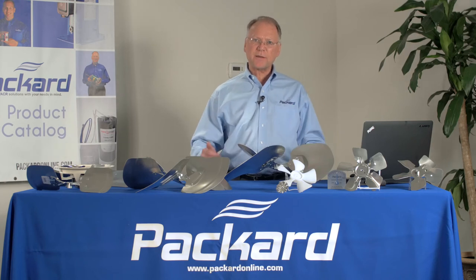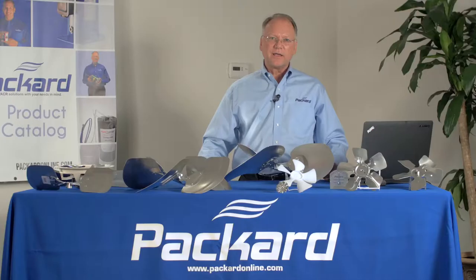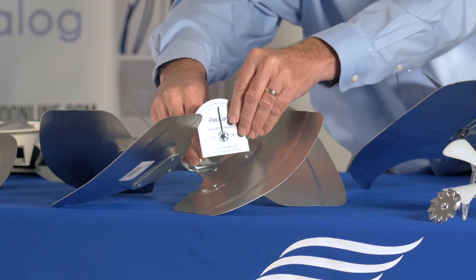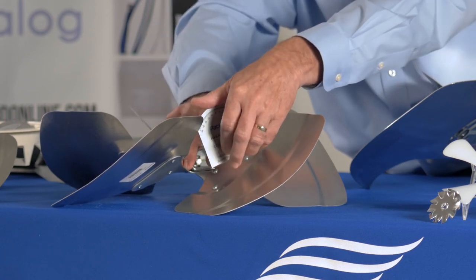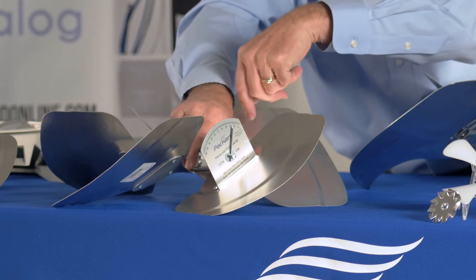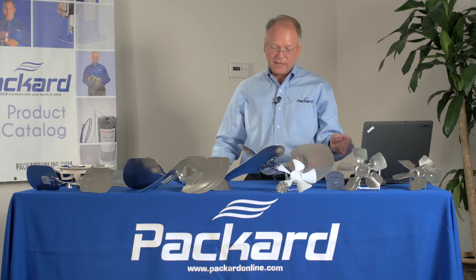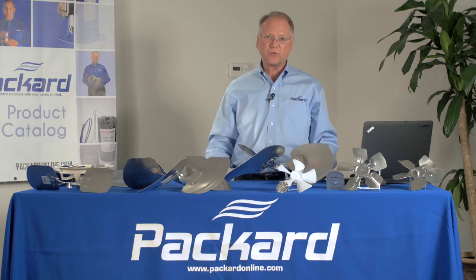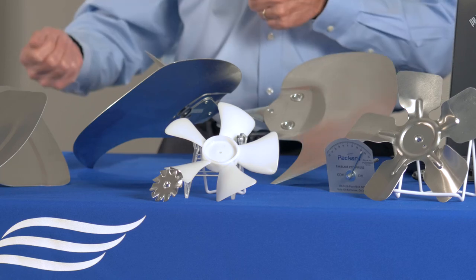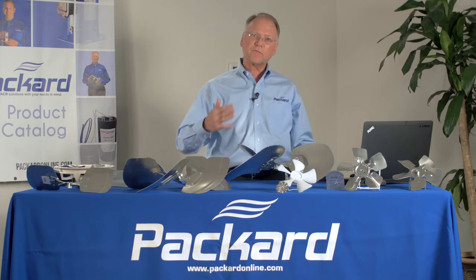The pitch can be evaluated using different tools. If the fan blade is relatively flat, a pitch gauge can be used to determine the pitch. The pitch gauge is placed on the spider and on the fan, and it will show the rotation as well as the pitch of that individual fan. Many fans are not flat, and it may be difficult to use a pitch gauge to determine the pitch. If that's the case, a formula is available that can help you identify it, but the fan still must be fairly flat — if there's a very large curvature in the fan blade, even the formula may not work.